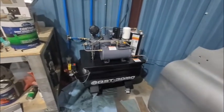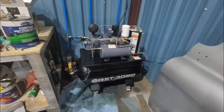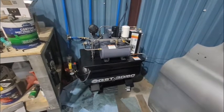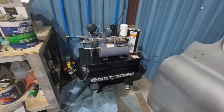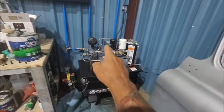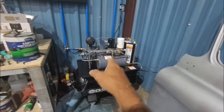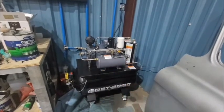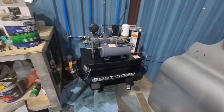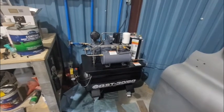I think that's a band-aid fix. I would not have bought this compressor if I knew I had to manually drain water out of the oil once a week. Oil and water don't mix — if that oil is lubricating anything in the scroll and it now has water in it, you're not lubricating properly. I'm wondering if that's what caused my other two compressors to fail early.